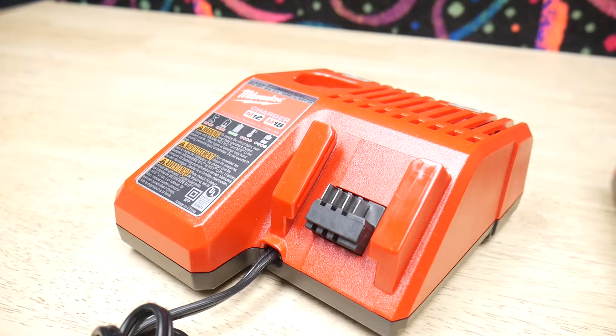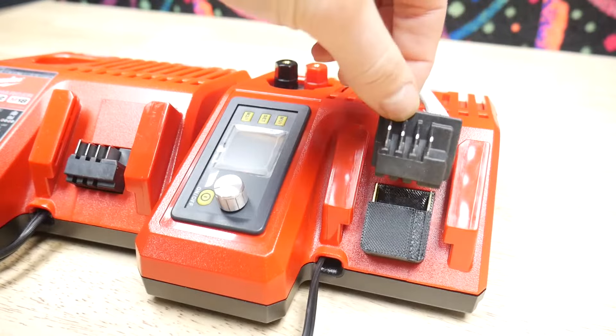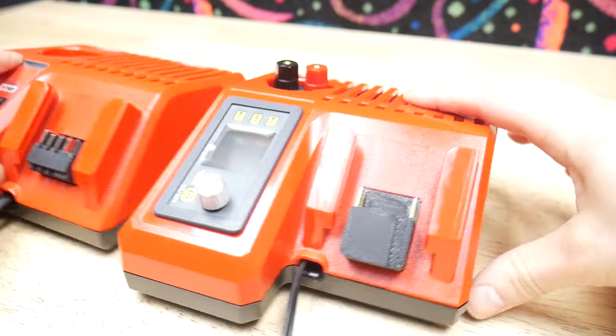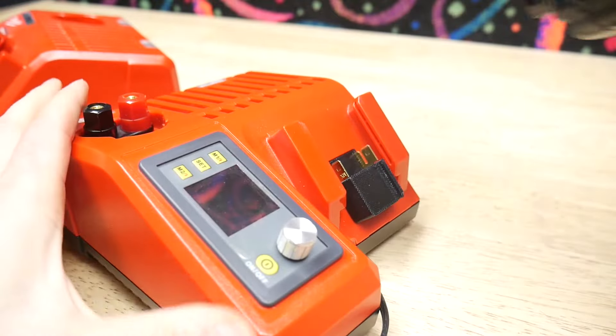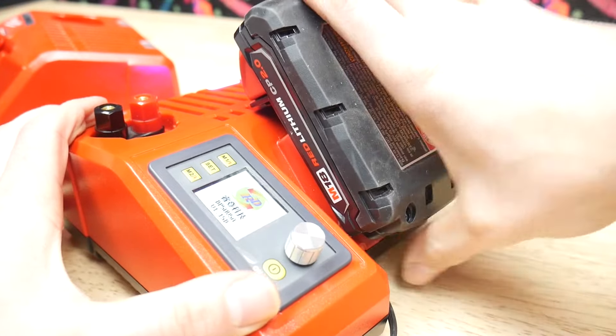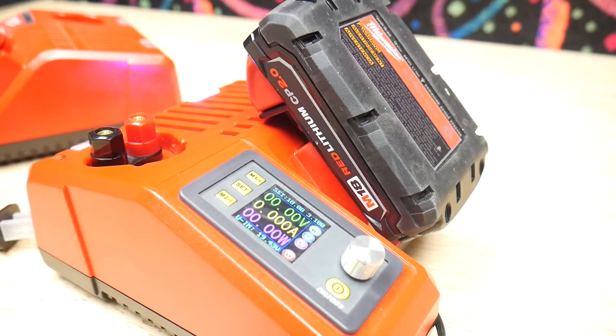With this design concept, you can rebuild the battery charge receiver. I removed the charge connector on this charger and replaced it with terminals at the battery's positive and negative poles. Adding one of these adjustable buck converters gives me a portable DC power supply for testing projects or powering soldering irons like this TS-100.